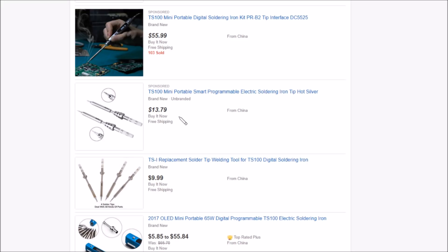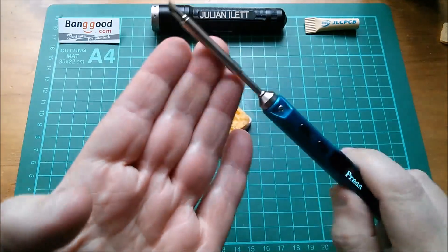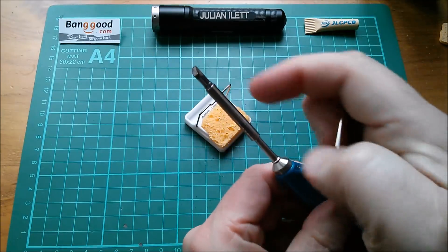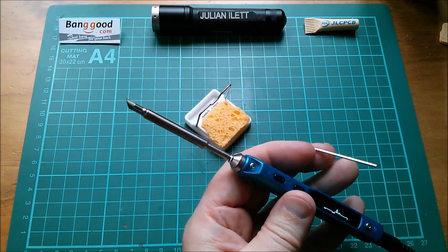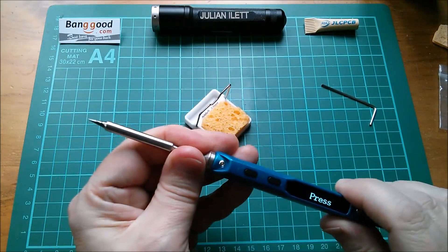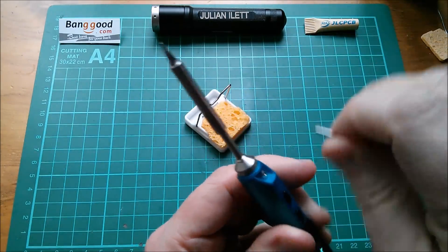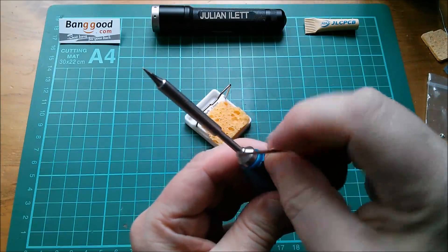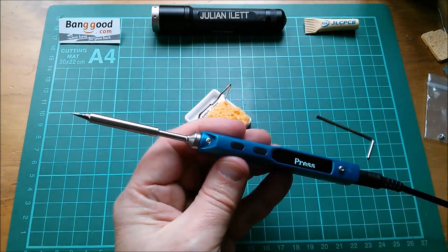While looking at eBay this thing has gone into standby, so it's cooled down now. I can take out this ridiculously big tip and put in something more appropriate for some surface mount work. I'll go for this one with a nice fine tip — this one is called a TSI. Let's tighten that one up on both sides; don't over-tighten — these are quite small screws. You've got to keep this allen key to hand because you need it to change tips.